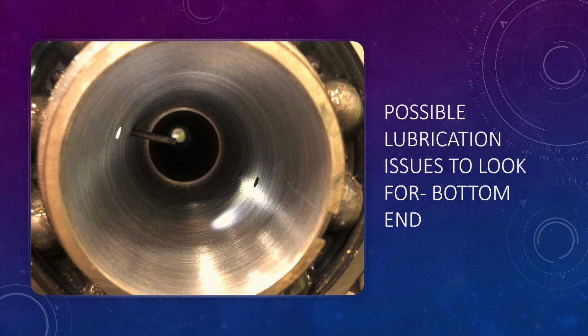One of the problems with it is that if we're putting a steady bushing in, you need to make sure that your steady bushing is above the two holes. You put the steady bushing in, and that's fine. And then I'm assuming you're going to think, okay, I'll just drill two holes back through the steady bushing. Well, when you put a head shaft down in there, and your tolerance is 3 to 5 thousandths, 3 thousandths is what you're looking for, you're not going to get any air through there. So you're going to reproduce the oil leak.